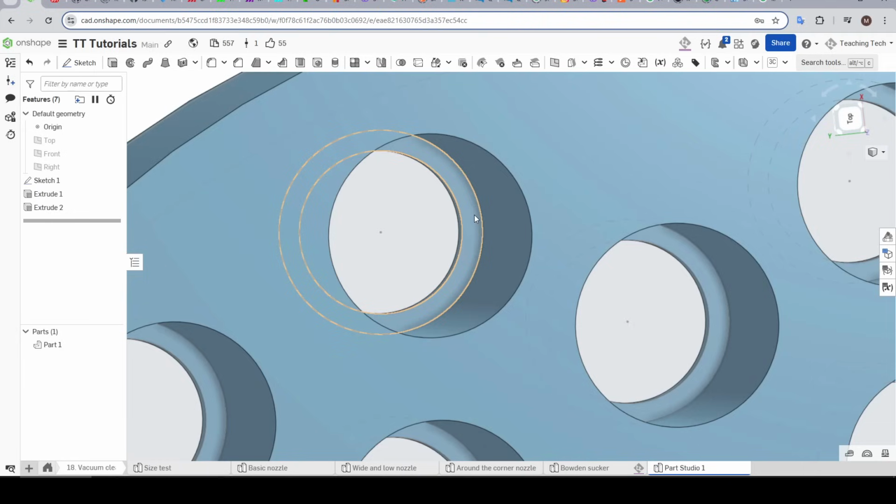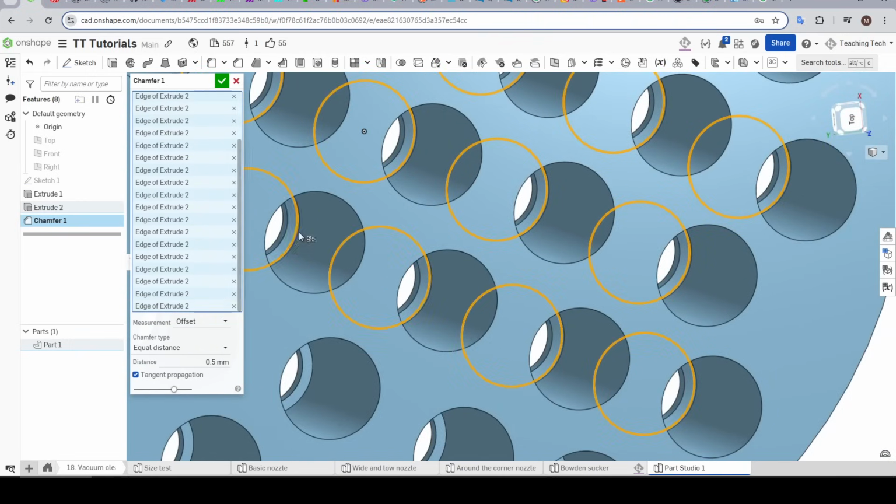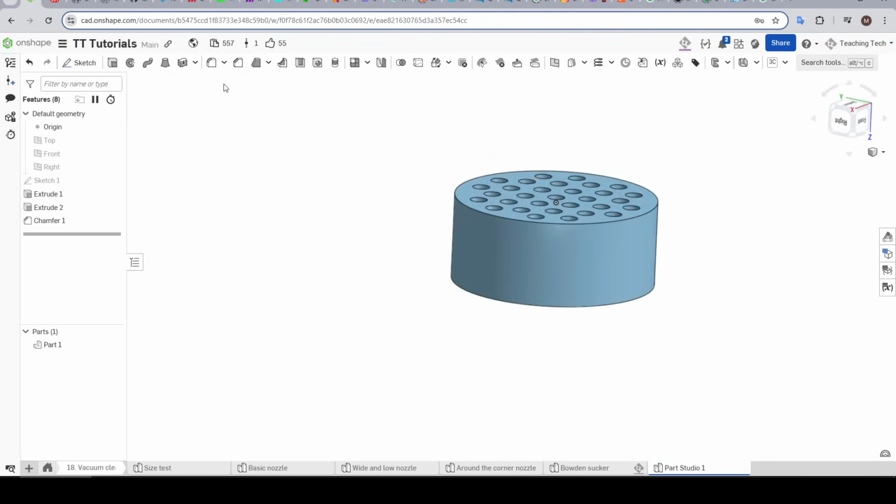but that's not going to like printing in midair, so rather than use support material, let's add a little chamfer. This step, once again, is easy, just repetitive. But once they're all in place, we can now print this without any support material.